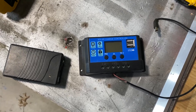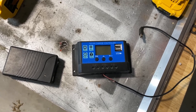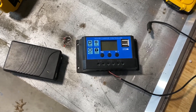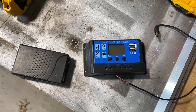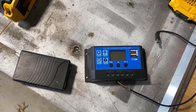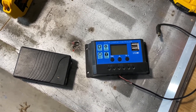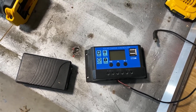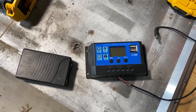You have to have enough batteries to keep everything on overnight and enough amperage to charge them back up. If I wanted this to run the greenhouse fans, I'd configure a battery source for it and run the fans through the thermostat. The problem I had was that the solar panels didn't put out clean enough power and the thermostat just kept clicking on and off — that's why I went ahead and wired it directly to the always-live 12-volt power supply.